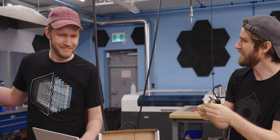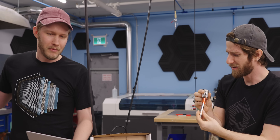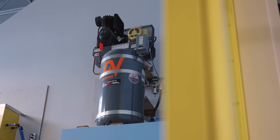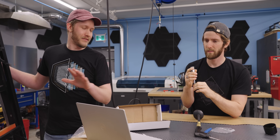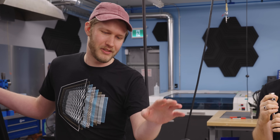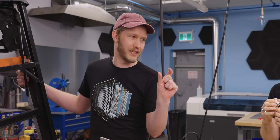At minus 50 degrees, this could be dangerous — like really dangerous. We can't quite do the 40 CFM nozzle because our air compressor, which is quite a good one, is good for about 19 CFM at 175 PSI. So we can probably manage the 25 CFM nozzle, and maybe use the 40 CFM one for a short amount of time.